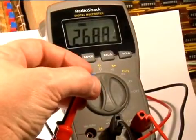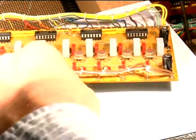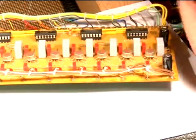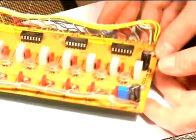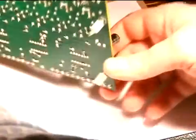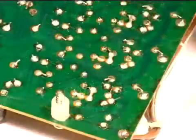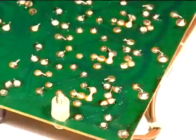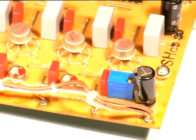About as good as you're going to get right there. With the pre-calibrated potentiometer, go ahead and install. Turn the board over and solder. One trimmer installed — repeat with the remaining seven, making sure that you calibrate each replacement.